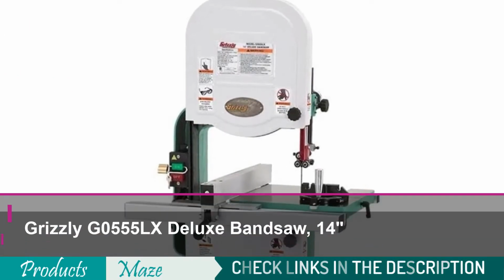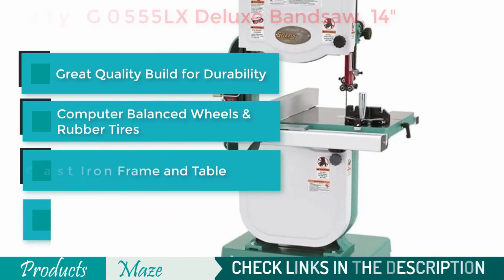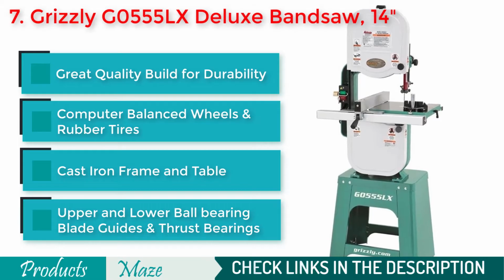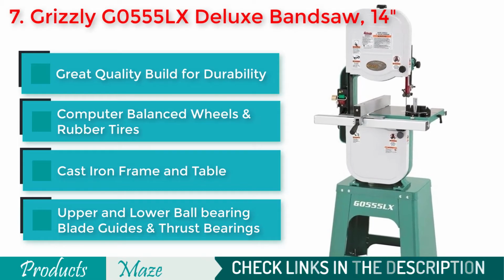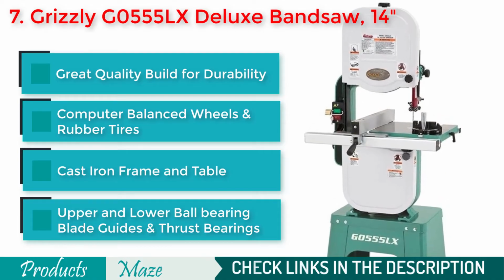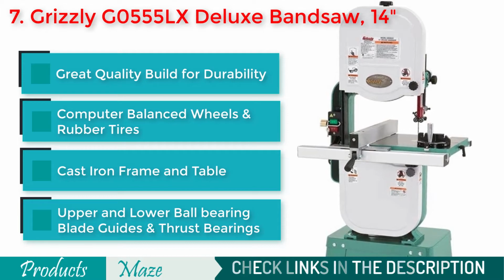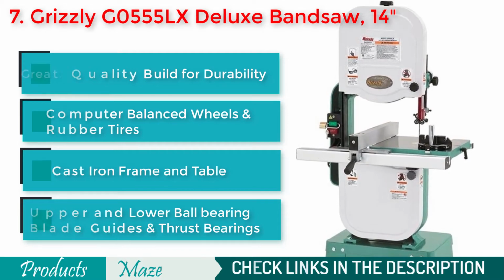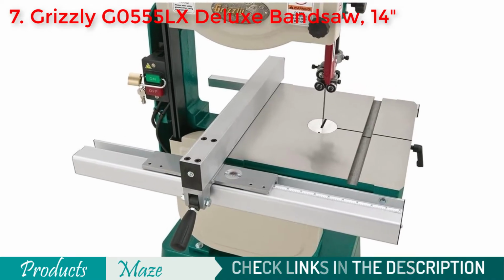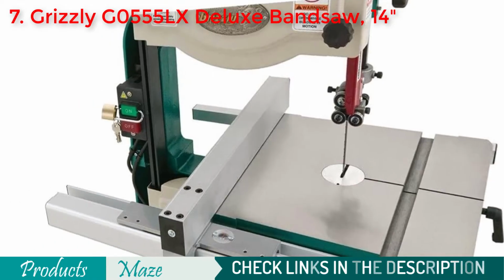Final product of our list is the Grizzly G0555LX 14-inch Deluxe Bandsaw. Another great quality and feature-rich bandsaw that comes with computer-balanced cast iron wheels and rubber tires for maximum accuracy. This Taiwan-built machine is made to last. Comes with a heavy-duty cast iron frame, precision ground cast iron table, plus upper and lower ball bearing blade guides with thrust bearings. This is another true contender for the top spots of this best bandsaw buying guide.